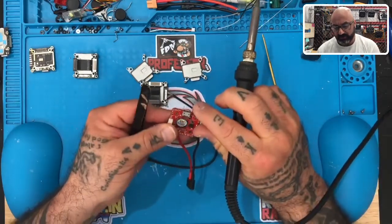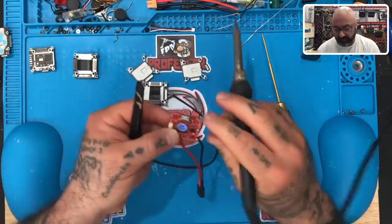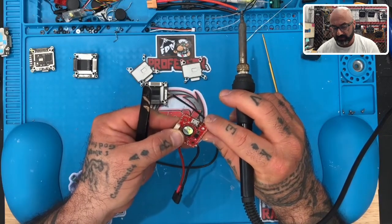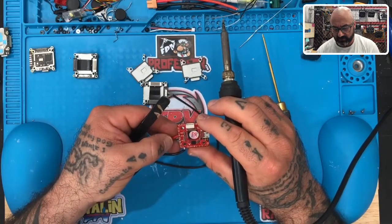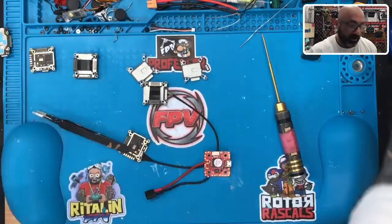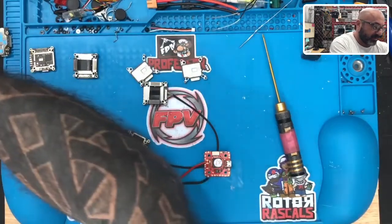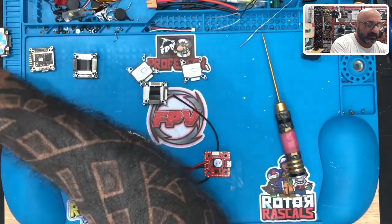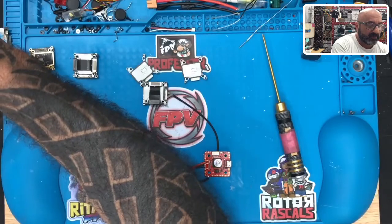You know, and I really wish there was another VBAT connection because that would make my life so much easier. And I'm going to look one more time just in case maybe I missed it. Okay, there's a 5 volt. No. Only one bat. Darn it. Well, I'm going to put the wires on here for permanent and keep it permanent. So let me just cut power to ground. And I'll actually end up using this board to test all of our setups, including if the OSD is working.